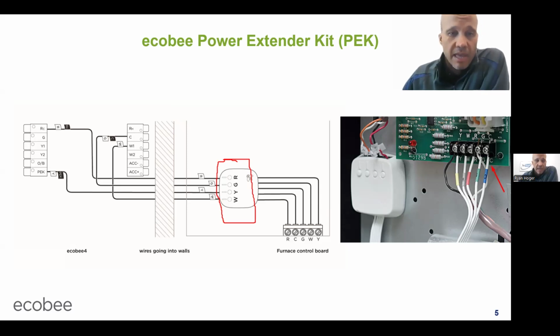So they made it easy for them. And for them, it means the red wire goes to R, the green wire goes to green, the yellow wire goes to yellow, the white wire goes to W, voila. But an HVAC contractor knows that he put this green wire on common. So when he goes downstairs to look for the green wire, he wants to land the green wire on common, but there is no common. And then he's like, what the hell? What's going on? And then he knows he used the yellow wire for PEK. So when he walks downstairs, he's looking for somewhere to land a yellow wire that's labeled PEK, but that doesn't exist. So the HVAC pro in his mind has to know that G on this box actually means C, and that Y on this box actually means PEK.